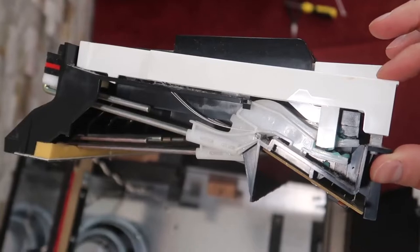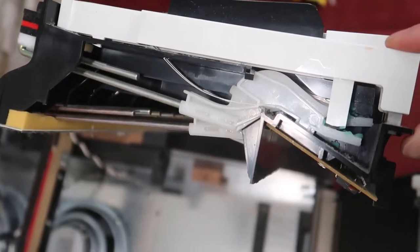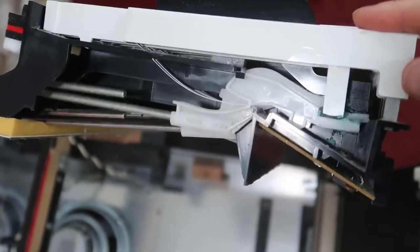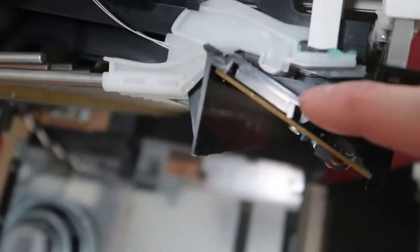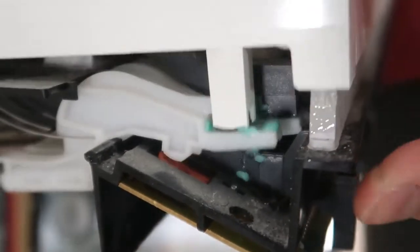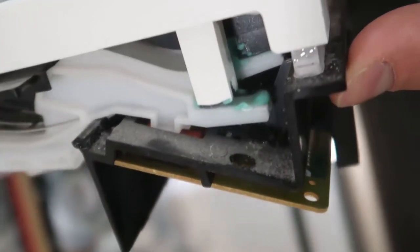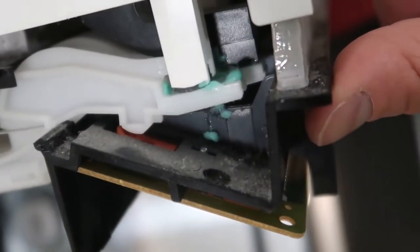Here is a view of how that piano action works. You have a hammer in the bottom that adds weight, and when you let go of the key it is possible for the key to come back a little bit — that is how they get that piano feel. This little piece here pushes on the orange pad in there, and that is what triggers the sense of the velocity and the fact that you have touched the key, and that is on the backside of the PCB here. So that is how the piano actuates. And all this blue stuff is not kids' gunk, it is actually oil, some kind of grease.